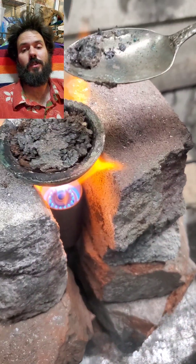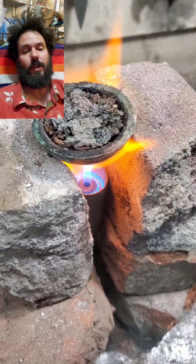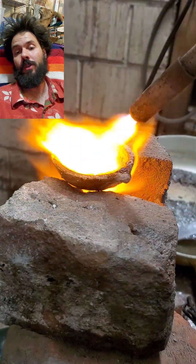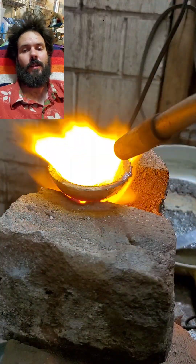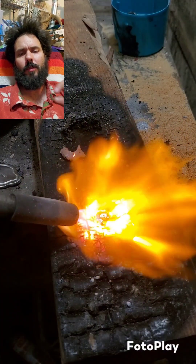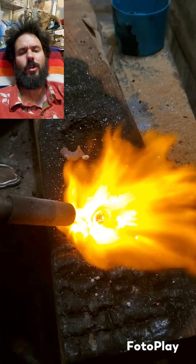The fun thing to do when you have a whole bunch of silver flake and want to find out if it's actually silver metal is to break out the torches and start melting stuff. I dish up my silver flake into a little crucible I got on eBay, put some washing soda in there, melt it down, and pour it out onto little pieces of wood to catch the silver. I had to re-refine them a couple of times — take it, put it on a charred piece of wood with more washing soda, melt the little globs of metal back down, and get some more of the impurities out.